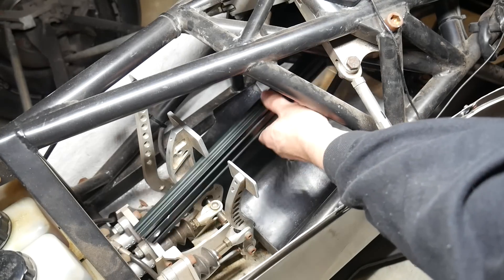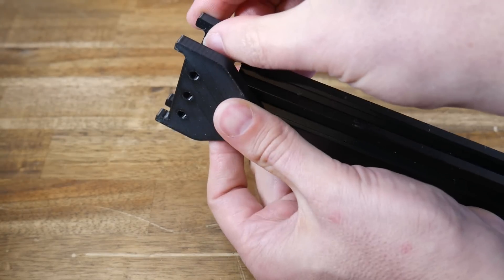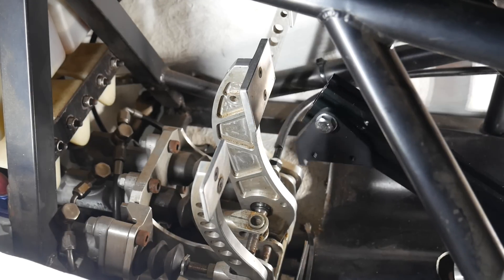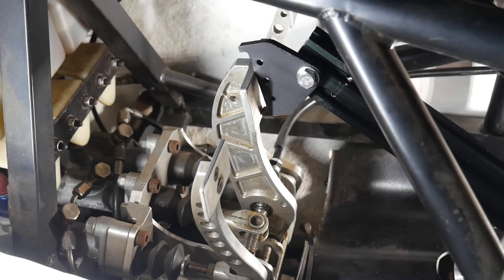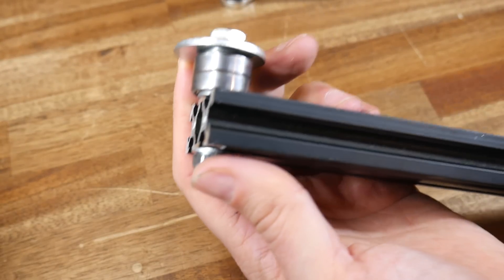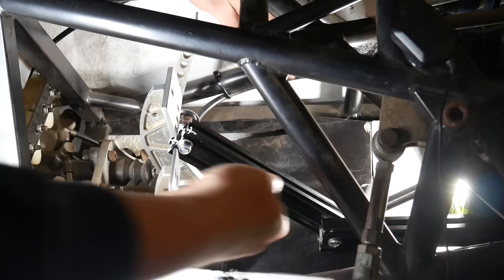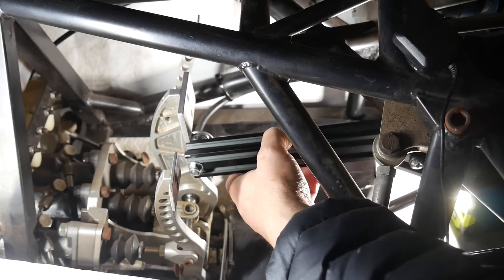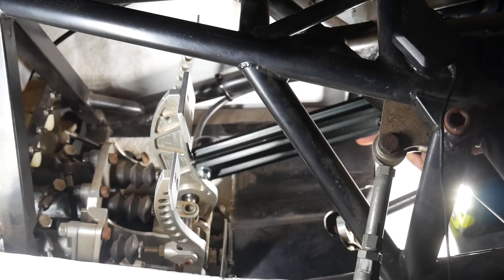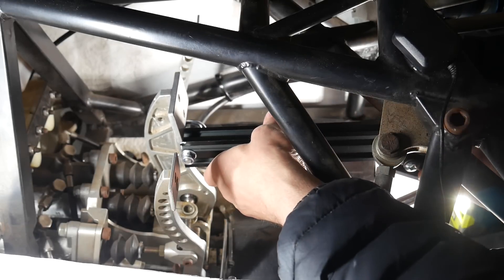But what about the pedal end? That still needed resolving. My initial idea, prototyped with 3D printed plastic, was to have an articulating ankle that would clip onto the pedal. But I won't have access from the camera's current view, so I figured that might be too fiddly — trying to align and clip onto the pedal when looking through from the cockpit. Idea number two was to keep things super simple and have a pair of bearings that would push along the pedal arm. This would be much easier to locate from inside the cockpit and the way it rolled helped protect the pedal. But the main problem was that this didn't attach to the pedal in any secure way, and the bearings meant the whole mechanism was likely to roll off the bottom rather than pushing upwards and latching onto the top. I was also concerned it would be hard to get the exact length needed to make everything lock into position accurately.